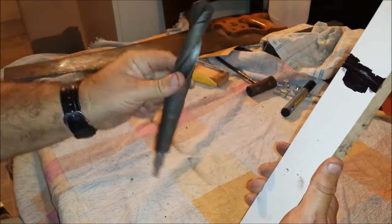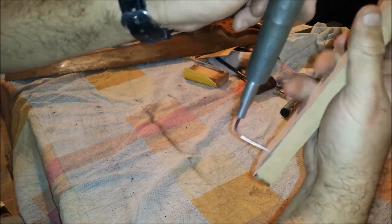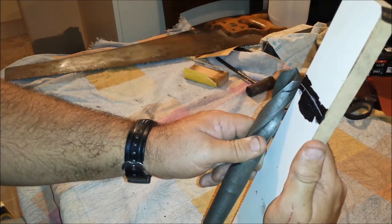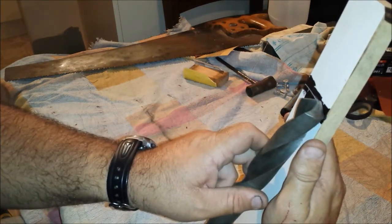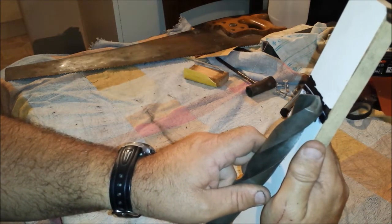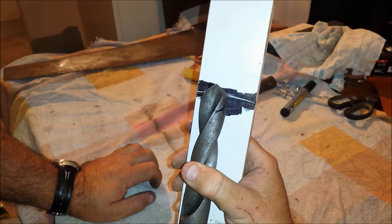What happens is you've got the edge that you know is at the right angle, you put the nail in the hole, and score a line on the laminate. But why? So that when you do the other edge, you're going to see if it's at the same angle — you score that line again. If the angle's out, it's going to be either higher or lower than the original line, and then you know that you need to re-grind. Such a simple trick and it can save so much work.